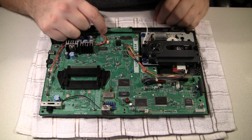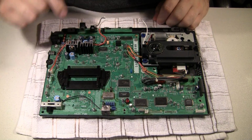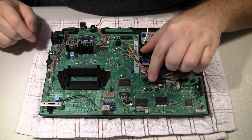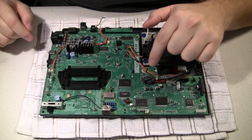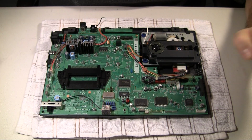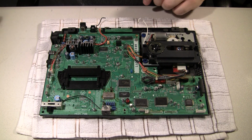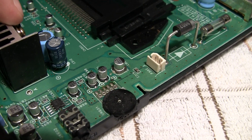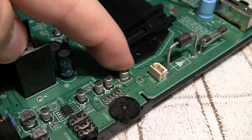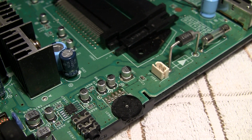but I can tell by looking at a few of them that they have been leaking a little bit. I'll get a close-up on that. A lot of them look pretty good, and we'll be able to tell by just looking at the solder. When they leak, the actual solder itself corrodes. Let me get the camera over here in a better direction. Okay, here's a row of caps that are actually pretty nice, but this one on the end, you can tell just by the discoloration of the solder that it's leaked and the solder's corroded.